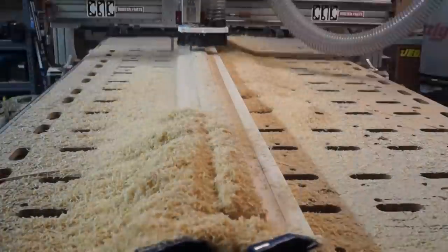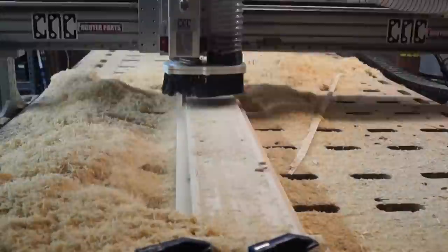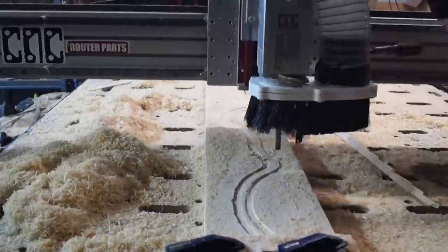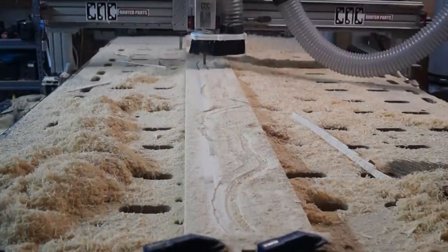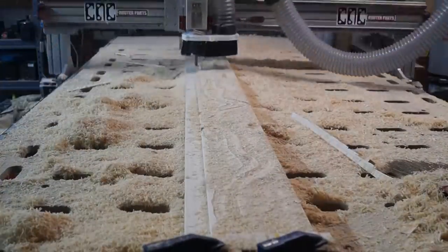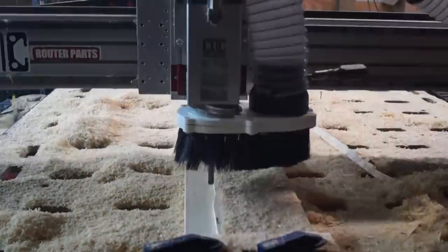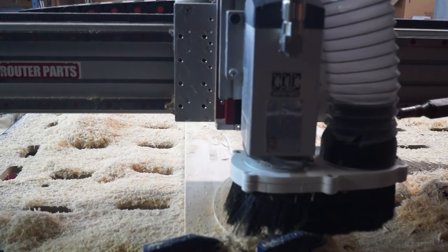This is just half of the light — I decided to do it in halves because when I designed it I didn't know I was going to be using the router. You take several passes, take out the big chunks, then start making the adaptive clearing passes to take out the bulk of the material. It's kind of fun watching it come out of the material.